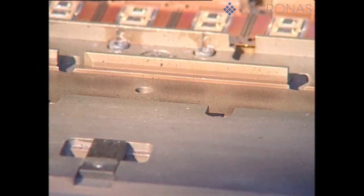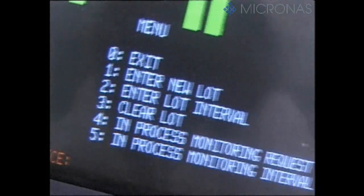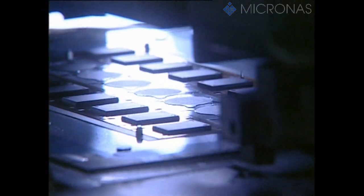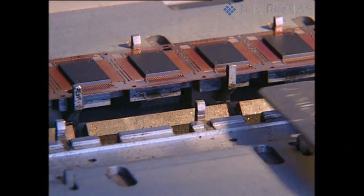To protect the sensitive wire connections from mechanical damage and to prevent the silicon dice from corroding through moisture, all the components are molded with a plastic compound under high pressure at a temperature of 175 degrees Celsius. The plastic compound used is a thermoset which contains more than 80 percent ultra-fine glass particles as a filler. This ensures that the difference between the coefficient of thermal expansion of the molding compound and the silicon die is kept as small as possible. The quality requirements placed on the molding compound in terms of processability, purity, and specified mechanical properties are extremely high, ensuring that the finished components will operate reliably over a very long period of time.